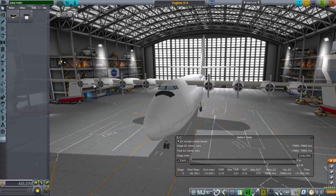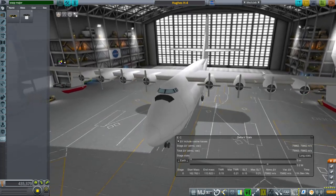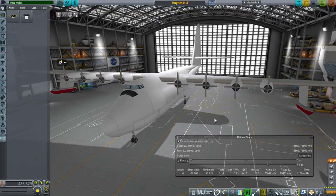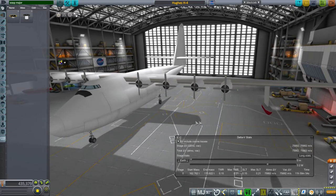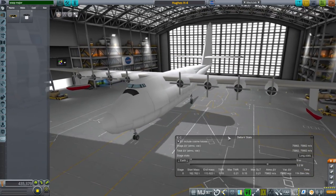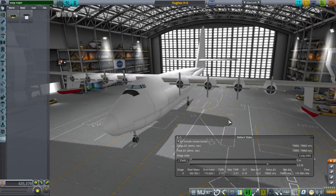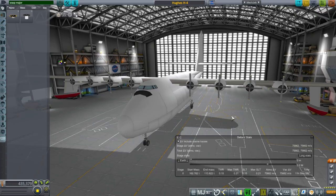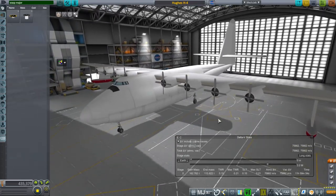It uses Wasp Major engines. The initial versions on the Spruce Goose were a little less powerful than the ones we have here — we have 3,800 horsepower, which is about average for the Wasp Major. Initially they had 3,000 horsepower and went up to 4,300. They were ultimately used on the B-36, which had six of these plus four jet engines. The B-36 had a maximum takeoff weight of 183 tons — higher than the empty mass of the Spruce Goose. The Spruce Goose has a maximum takeoff weight of 180 tons, so slightly less, but the B-36 needed its jets to take off on any reasonable airfield and still needed a pretty long airstrip.